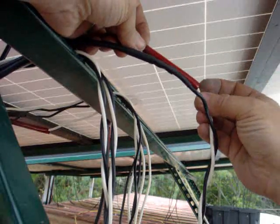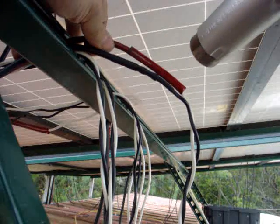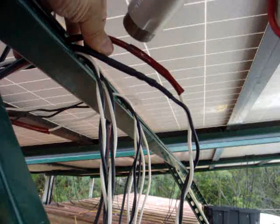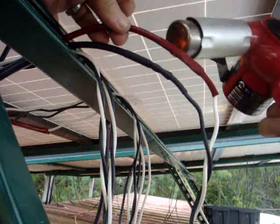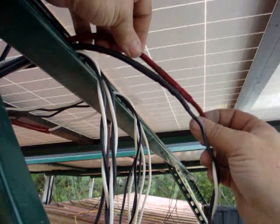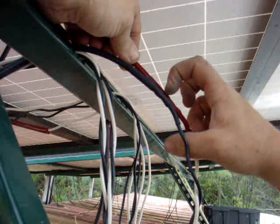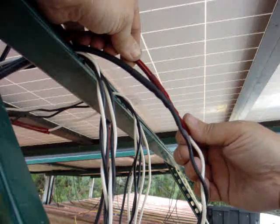Some heat shrinks have hot glue inside — that's about dead center, that'll keep the weather out. Keep the heat gun moving; it's already starting to shrink. There we are, get the other side. Make sure the end closes up all the way. That's a proper heat shrink right there. If you turn it you can see where it's been crimped — you can see the full shape of everything. This is real close to the insulation, which makes it strong.